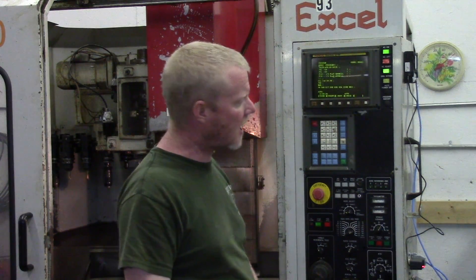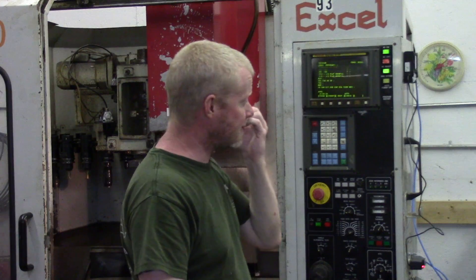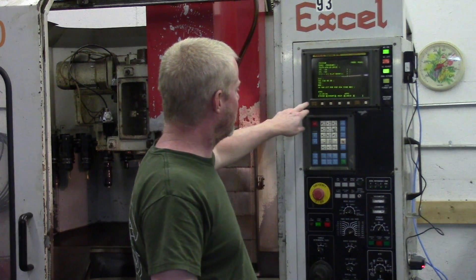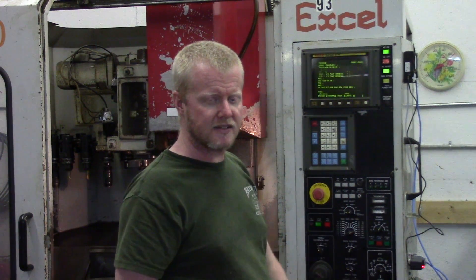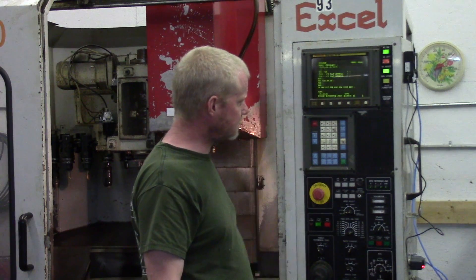I fixed the monitor. It still has some sideways skew, but all the scan lines basically had too much brightness. It's scaled out larger so it doesn't look as compressed. This will do fine. I'm considering doing the LCD upgrade, but I haven't confirmed with any vendor that has one whether they're doing a single-color video adapter inside their module or if they actually support RGB. On this OM series, I've dug through the parameter list — there is a color option and these do output RGB values. I saw a couple of online shots of the OM series with a color LCD.